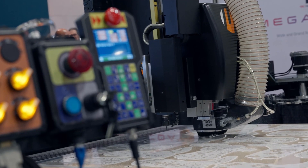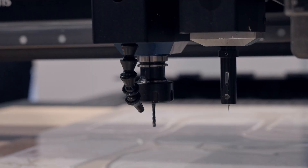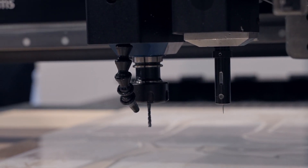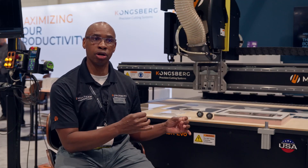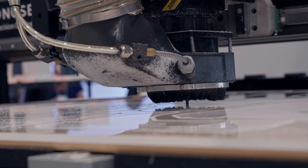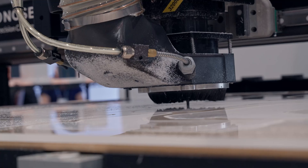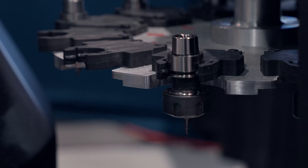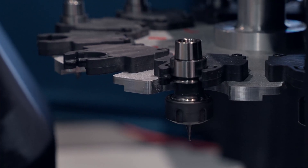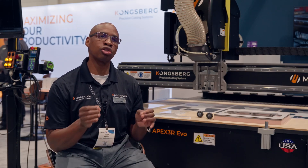The other thing we've added on the EVO is the tapping unit. It's a huge improvement because it makes workflow much more convenient — you can drill and tap your part while it's still on the table, so when parts come off they're ready to go. The tapping unit also supports automatic tool change, so you can have different tapping bits in different holder locations, and if your file calls for a different thread, the machine will automatically pick up the proper tapping bit for each thread.